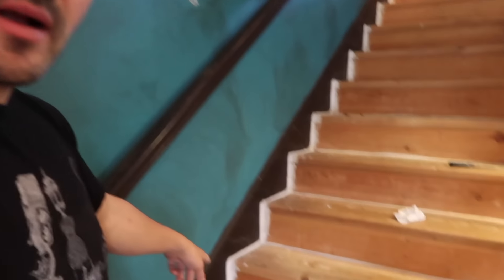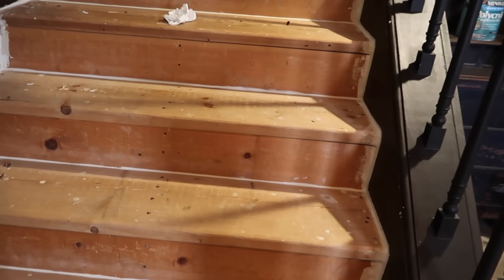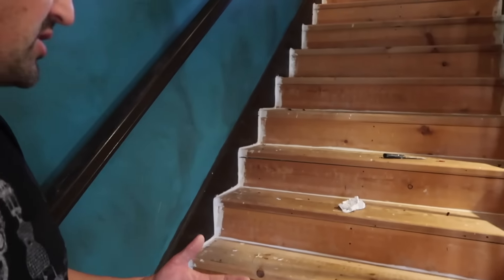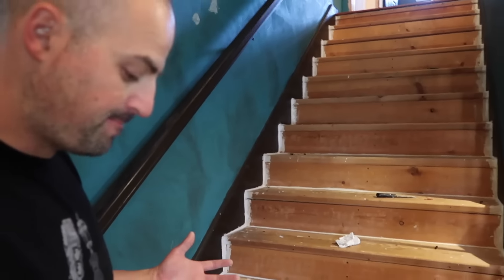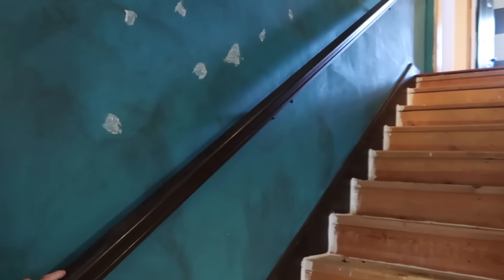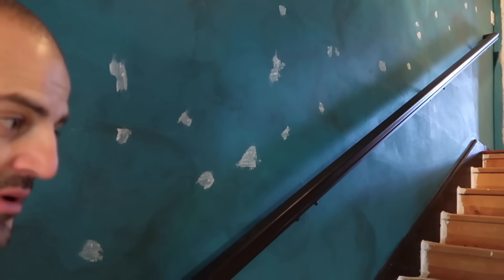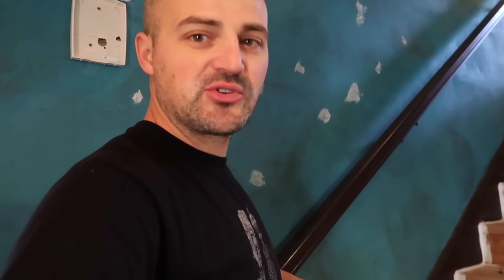Here's a little progress shot — I caulked everything around the edges along the sides, because this was original wood stairs built to be covered with carpet, so it wasn't a finished wood. I went ahead and took all the pictures off the walls and filled in all the nail holes. I'm going to paint the stairs first so that if I get any paint drops on the floor I can sand that down before staining.